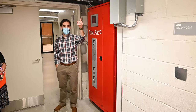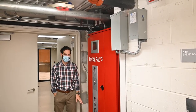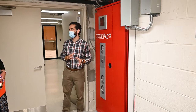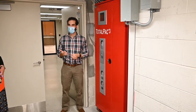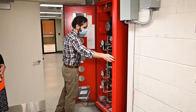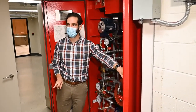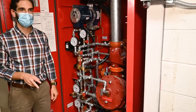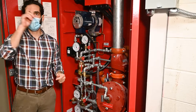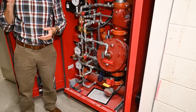Can you explain what a pre-action system means? A pre-action system means that it is dry until a solenoid operates to let water into the system — usually controlled by smoke detection or a pneumatic system. For this building, the pre-action system works by two smoke detectors going off. The two smoke detectors have to be in the same room. Any two smoke detectors that go off will trip a solenoid, which drains water off the top of the valve, allows it to discharge, and fills the system with water. Nothing will come out until a sprinkler head gets hot enough to break.